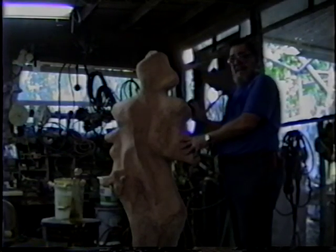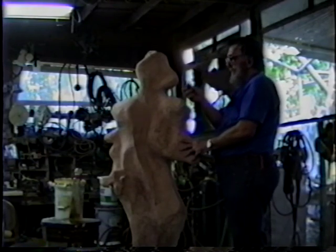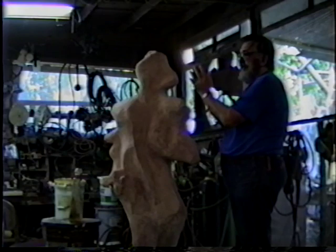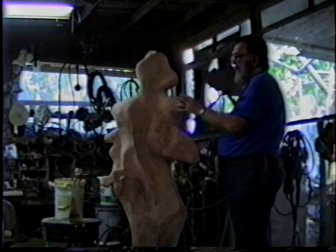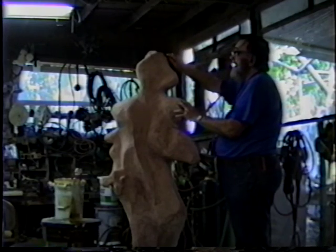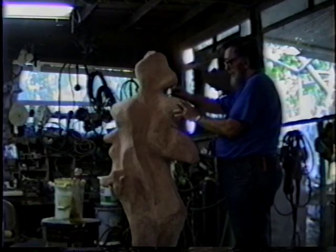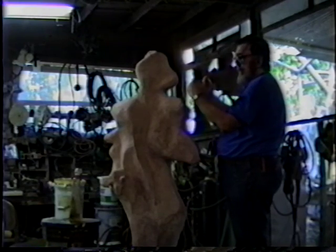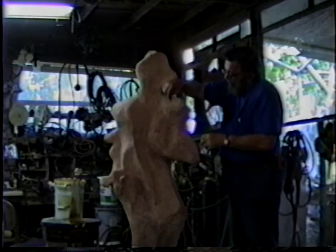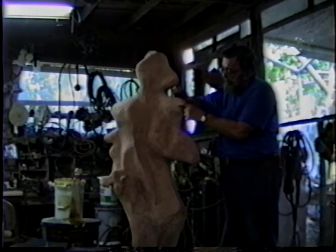The next step is to do the welded sculpture, the sheathing of this. So the first thing to do is take some kind of a marker and mark where would be a mold line if you were to make a two-piece or a three-piece mold that you're going to take apart. So you want to find places that don't have too radical an undercut. So you just put this marker along the surface that you think things would pull apart easily without having too big an undercut and can't get off on one side. Say if I make the mark over here, but then the copper would be here and it would be very difficult for it to get off. You'd have to bend it up to get it out.